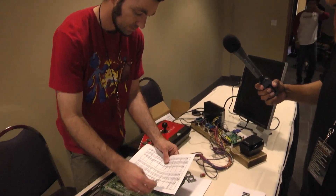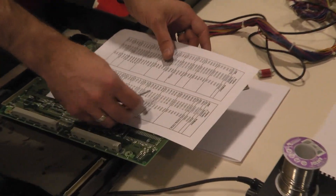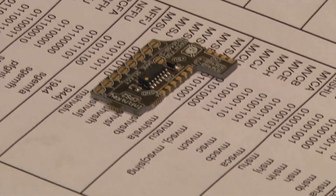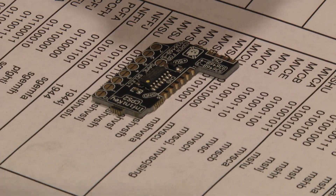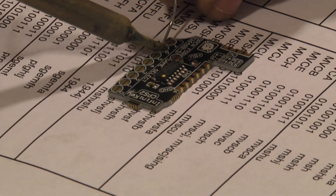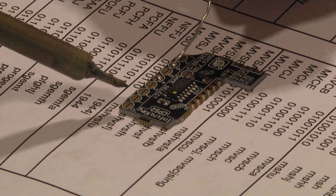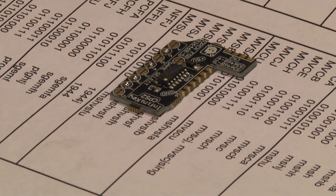So MVSU — with this cheat sheet here, we know which things we need to solder on for our jumper code. We've got 0 for unsoldered and 1 for soldered. Is that just 8-bit binary? Yep, just an 8-bit value.